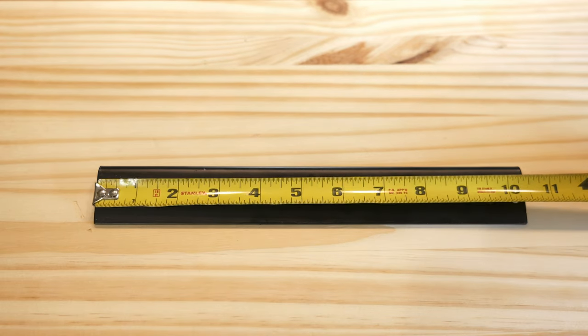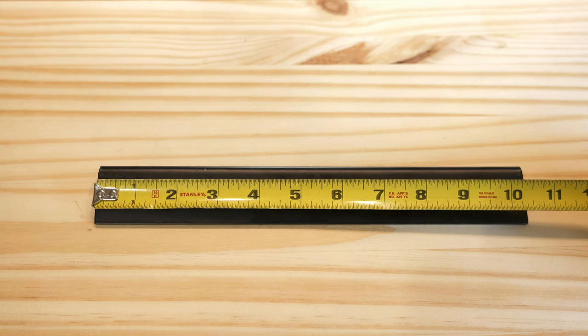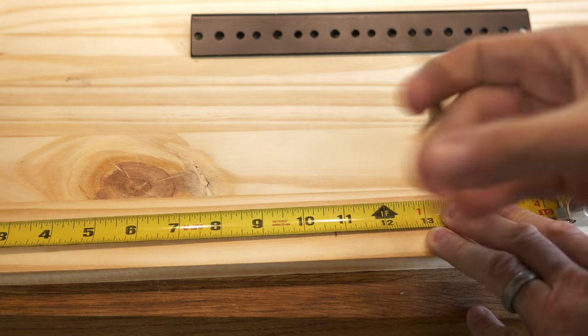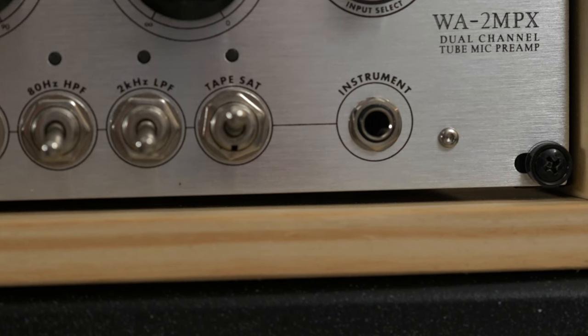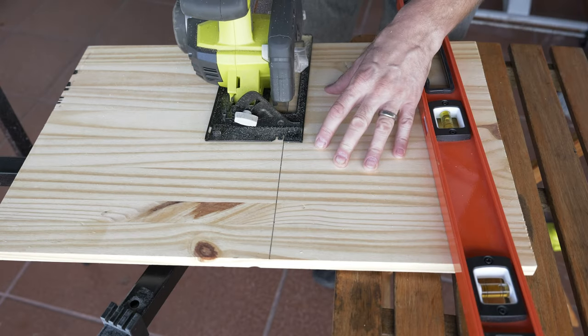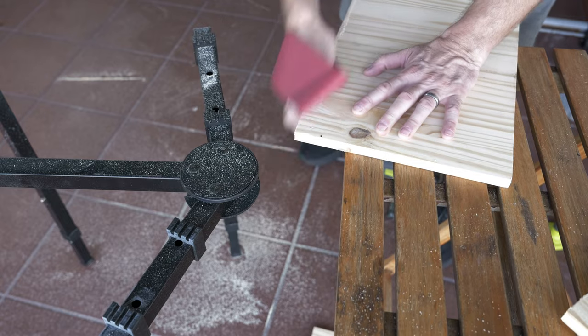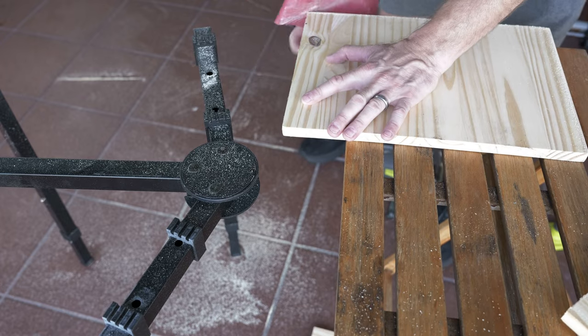First we're going to cut our side pieces of the rack. To do this, we measure the length of the ear and then add an extra half inch for the cut. This half inch gives us an eighth inch on the top and the bottom of the ear, so when we insert hardware into the rack it has an eighth inch gap on the top and bottom. This allows for a little airflow to keep the hardware units cooler, since they can tend to heat up when they're inside a rack. After cutting both sides, go ahead and sand off the edges all the way around each piece to give it a nice rounded feel on the corners, removing any sharp edges or cut remnants.